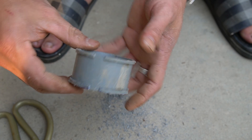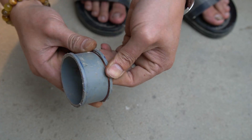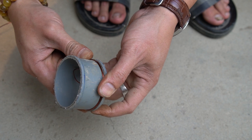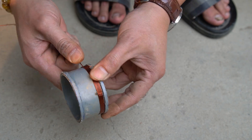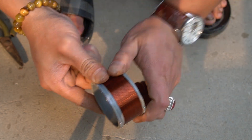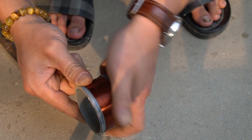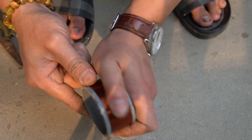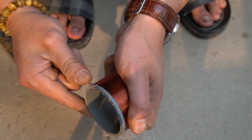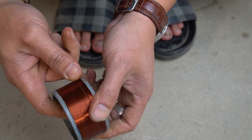Use specialized glue to attach two pieces of 2 millimeter plastic to the two ends of the 4 centimeter PVC pipe. We used 1 millimeter copper wire wrapped around the newly made 4 centimeter PVC pipe. Note, do it carefully so we have a beautiful and effective coil.